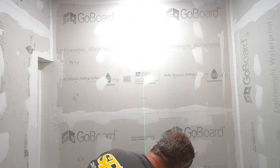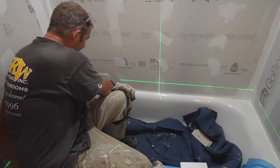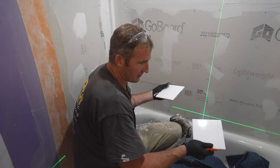Okay, so going from the center, if you want to check out your tick marks, just work your way over and see what it'll look like in your corner. This will most likely be a 5 inch piece or 5.5 inch piece, somewhere in between there. Let's see here. Yeah, we got 5.25. So that works out great, because when we do a staggered pattern, 5.25 is less than 6 inches, so we'll probably be about 2 3/4 inches for your other pieces on there.